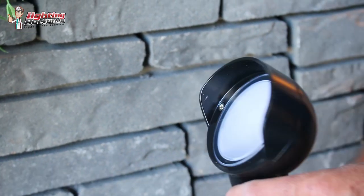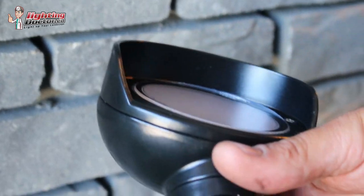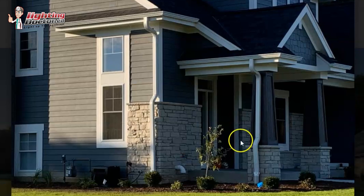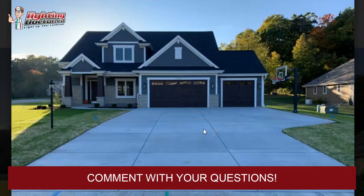A wash light is very similar to an uplight, but it's a wider angle and a lot softer light. Why that's good back there is because you can bring it back a little bit more, and it's going to do a nicer job of just lighting the brick from down below. It's not going to be too bright in the window, and it's going to give you some backlight in this area so it doesn't become a big dark spot. I think you can probably do the same along this wall over here, and then I would sprinkle some path lights in between.